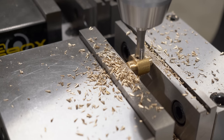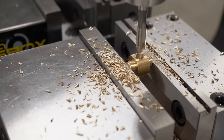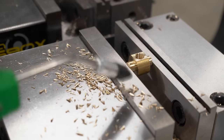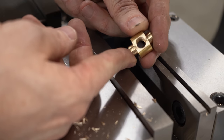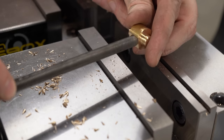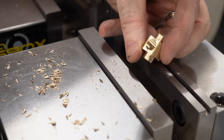We just ran the tapping size for 3/8-24 through here, and I'm power tapping with a 3/8-24 spiral point tap - this just goes right through the brass with no lubricant. I'll take the tool out so we don't cut our hand on it, then take the part out and see how we did. There are some burrs raised around the tapped hole, so I'll just grab a rotary countersink and knock those off. With that, this part is done. A piece of 3/8-24 threaded rod fits easily - nice and tight, runs smoothly on the brass - so this one goes in the done pile.